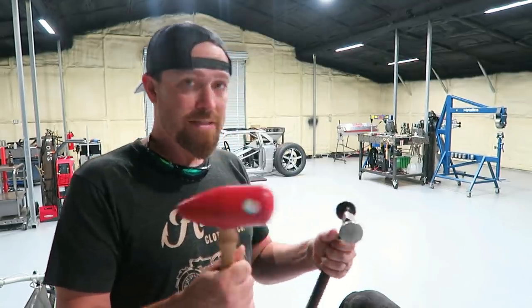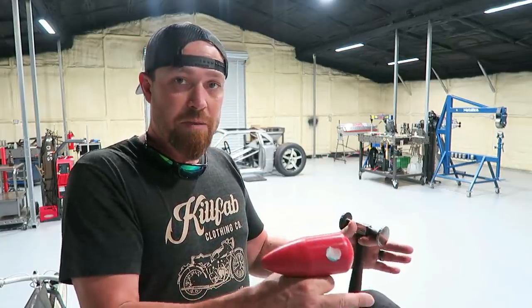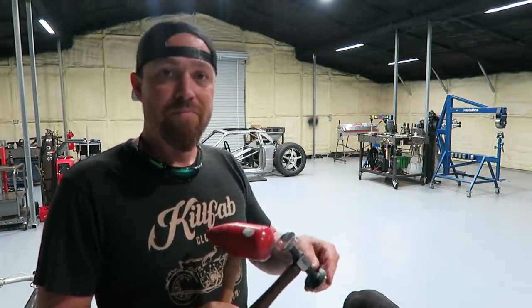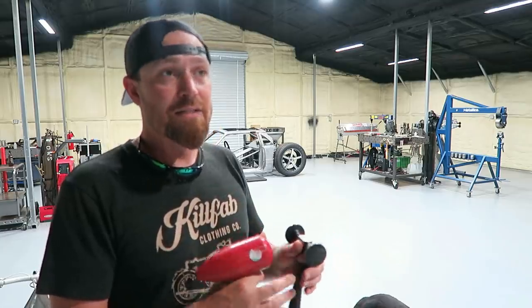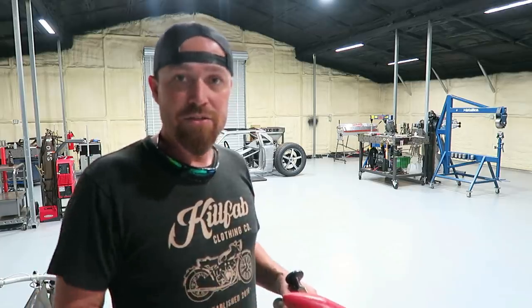So in the past, I've seen guys make kind of metal deals where they can put their bead bags up top, they can kind of beat panels out. They've got fixtures where they can do rounding over dies and that sort of thing. They can use their planisher and kind of shape metal. And then there's guys that have what some of you may know as shrinking stumps. So they basically take an old tree, they cut it off at the right height, they put this concave section in it, and that's how they use it to shrink metal. It's a shrinking stump. So I kind of want to do a mixture of the two.